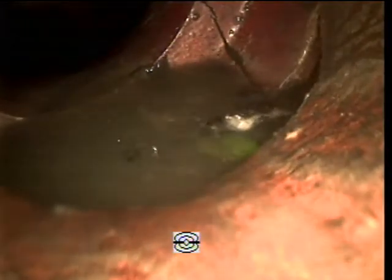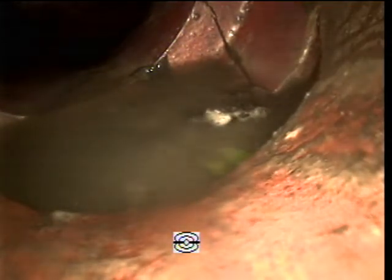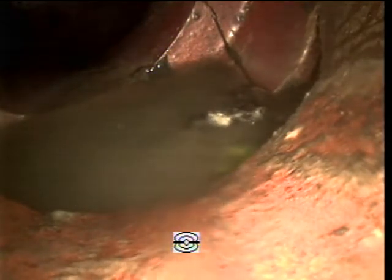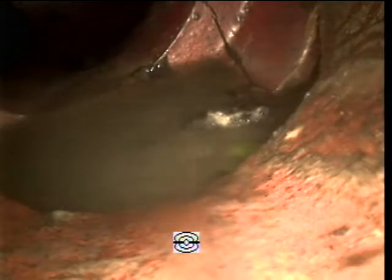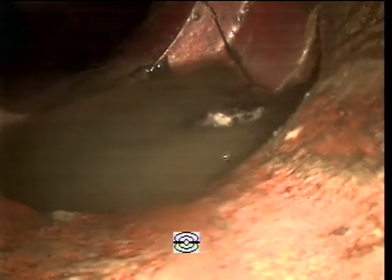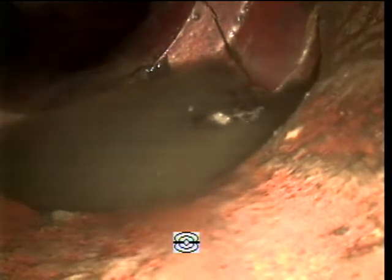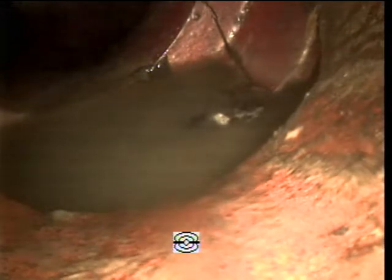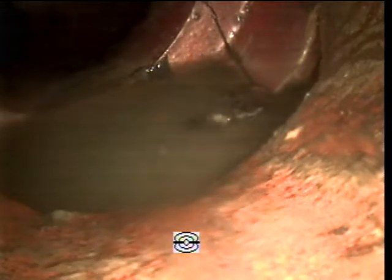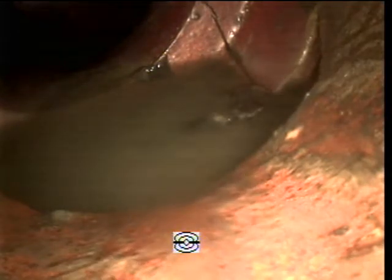I'll pull this back. So, we'll still shoot this too. Okay. So, we got a broken hub, and the hub's completely separated right there. That's why it's all leaking in like that. So there's actually I&I happening here, it looks like to me. You might have some groundwater coming in right here. Now, as you can see, that's at 86 feet 3 inches. So I just located it out front. It's maybe a couple, 3 feet before it hits the main. It's very deep. It's 14 feet deep.